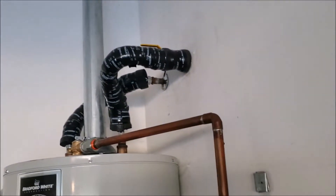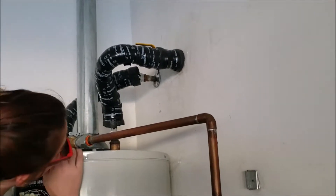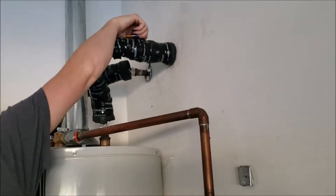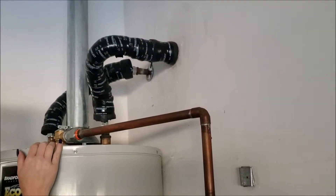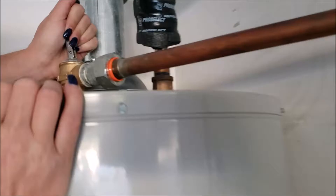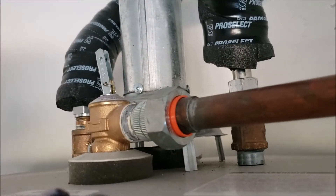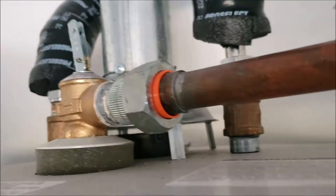On this installation we have a quarter-turn valve right on top — you can't see it because there's insulation, but it's just a quarter turn on, quarter turn off. Now the water is off to the unit. Then we're going to pop up the relief valve pin — stand it straight up — and what that does is release the airlock on the system. If you don't open a faucet inside or the relief valve here, this water heater will not drain.